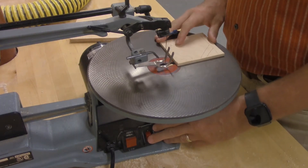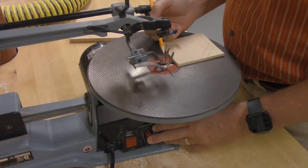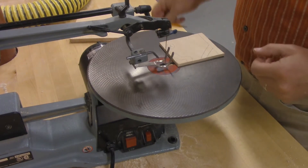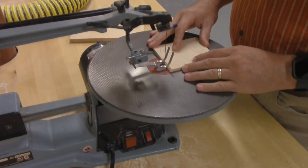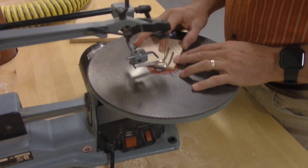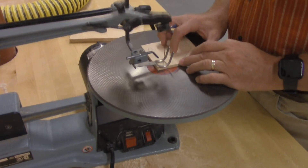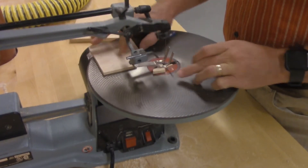Turn the machine on and then slowly feed the wood in. The sharp part of the blade is the part that's in front, and that's the part that does the actual cutting. That's the part you want to keep right on the line. The trick is you need to anticipate and rotate the piece of wood as you're going so that the front of the blade is always following the line. It will take some practice. Hold the wood down a little bit while you're cutting. Rotate the wood as you're cutting and follow your line. If you press too hard, the blade is going to push back and it will end up breaking — you'll hear the machine starting to labor. Don't push too hard. Please take your time. You can do your sharp corners and do your cut.